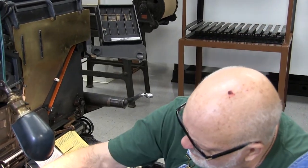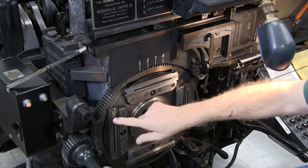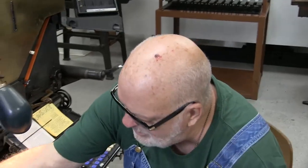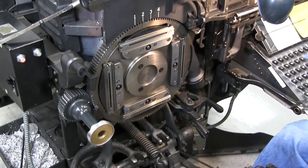This mold polish is also good if you have a mold that's sticking and your slug is hard to come out. You can get a long thin popsicle stick or whatever will fit, put a little polish on it, and go inside your slot to clean the bottom and top of your mold on the inside — that's just a quick fix. The best way to remedy it is to take your mold off and polish it completely so everything's off, it's good and shiny and clean. You can also clean your liners at the same time, then put everything back together. But these are the main things you can clean quickly to get you back up and running if you have a job you need to get out.